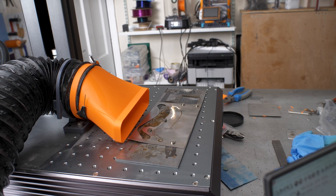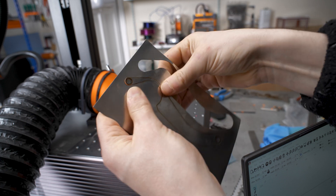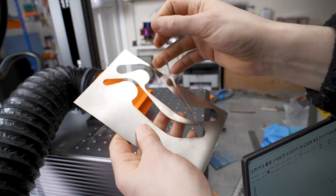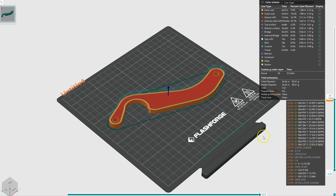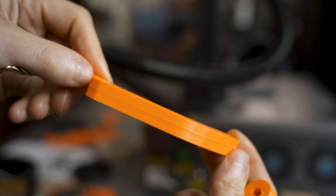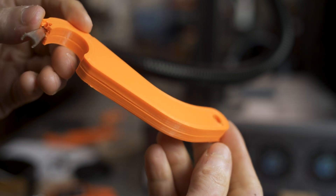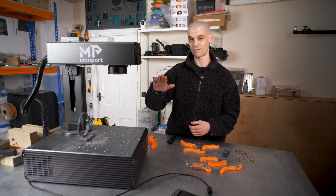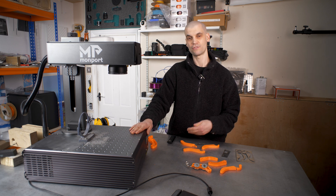I'm actually quite happy with that result because cutting out the solid steel sheet — without the trusses — is quicker and there's less post-processing to remove all those triangles. I thought the mid-print reinforcement style would be one of the most annoying methods, but it's actually pretty easy: in Orca Slicer you just right-click to add a pause into the G-code. With the Bambu P1S I've got, there's a tiny bit of layer shifting but it's really minimal and the prints turned out very nice. If you've got any ideas for other ways to reinforce 3D prints or use a fiber laser with 3D printing, let me know in the comments. Thank you to Monport for sending me this laser — it is an absolute beast — and a full review will be coming soon. That's it for today, thank you for watching!